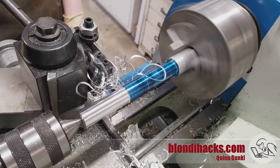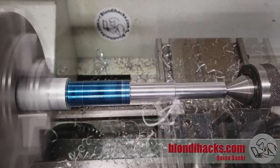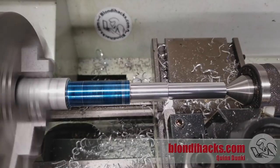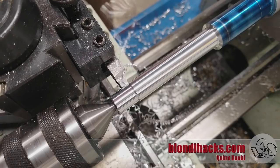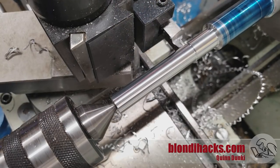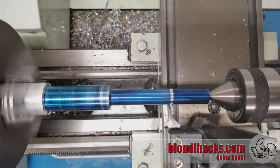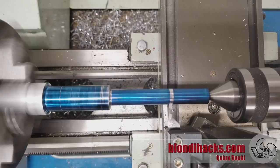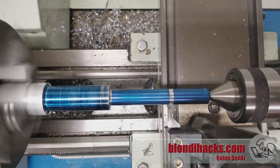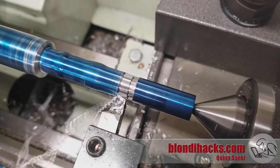This is kind of a barbell-shaped part. I'm turning that whole lower section down to the diameter of the next largest, which is the stubby end where the square clevis threads in. My speeds and feeds are finally cooperating — I'm getting decent chip action and decent surface finishes. Now I'm going to turn down the skinny barbell section in the middle, and to do that I'm using a parting tool to cut in on the shoulder so I have clearance for getting my turning tool in there.